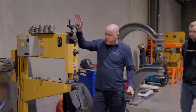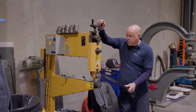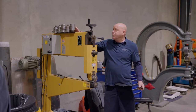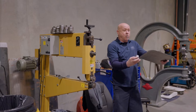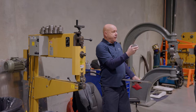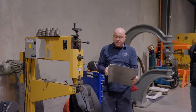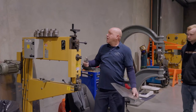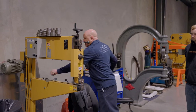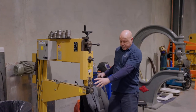The bead roll machine has a quick release that allows the dies to be changed, so all these different dies and attachments can go on there depending on what bead you want to do. There's the little joggle bead that's just a 90 by 90 by 90, so it just does a little tiny recess. That would be nice on the edge of a panel where you're recessing one into the other to get the material on the edges sitting down into a little bead. It's self-explanatory — there's an Allen wrench right there, and it sets up doing the different dies in and out.